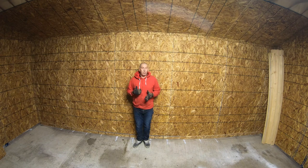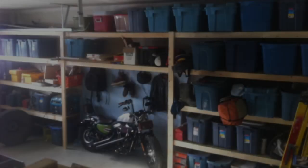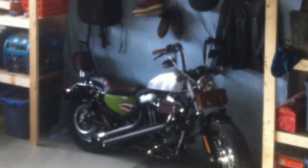This is a pretty standard utility garage shelf I've built many many times. Here's an example of one I built years ago that had a motorcycle in the center section. That garage was 24 feet, so it worked out perfectly with three 8-foot sections. The ceiling height was 10 feet high, so I spaced my shelves at 2, 4, 6, and 8 feet.